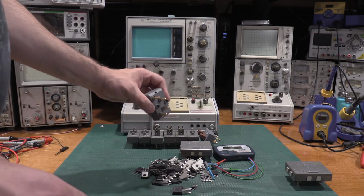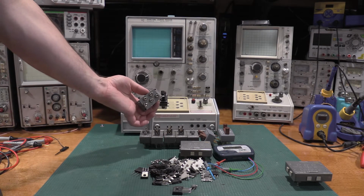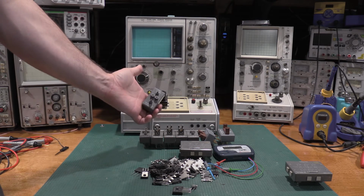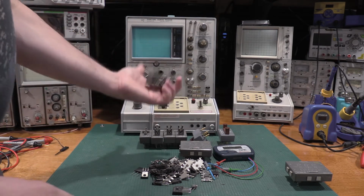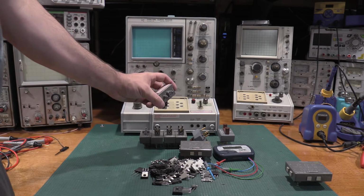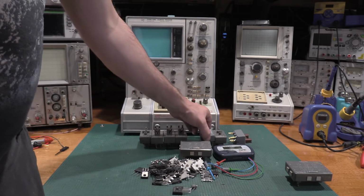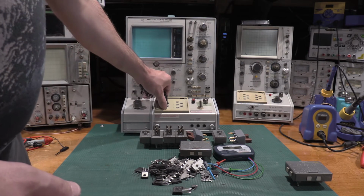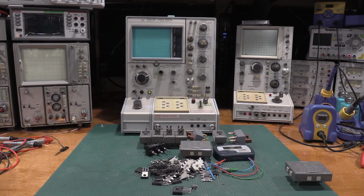So all the 4-terminal devices, they're all Kelvin sensing. You can even get Kelvin sensing on 5 terminals, which are for transistors. This is for a TO3. There's also a fixture for a TO66. I only have one of the TO66s. I need to get another one so I can do matching, but I haven't had to test many TO66 transistors. It's primarily been TO3. I do have a TO3 transistor.